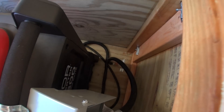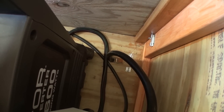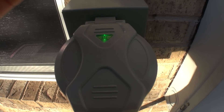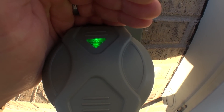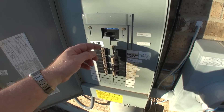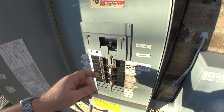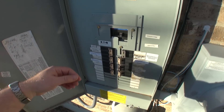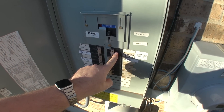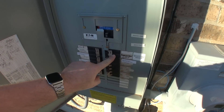The power line runs out of a small trap door in the bottom and connects to a 50-amp inlet into my home. The inlet connects into the main breaker box via a 50, or in my case a 60-amp breaker that's used basically as a switch. Breakers are really nothing more than switches that will automatically turn themselves off if too much power passes through. So the generator connection to my home can be switched on and off with this breaker.